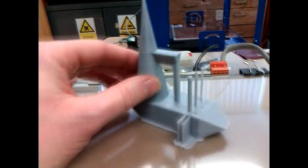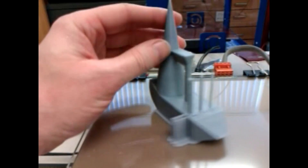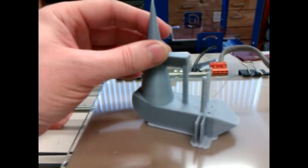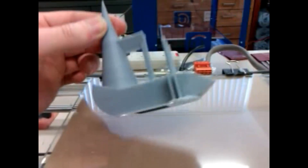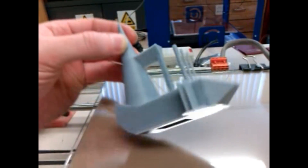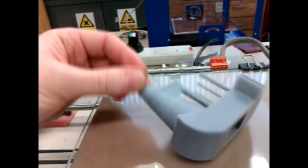I don't think I've got the extrusion multiplier dialed, and I've basically not touched that setting, so the small hole is not quite all the way through. The other two are fine. The 0.4 millimeter wall didn't print, although the extrusion width defaults to 0.4, so I haven't played around trying to solve that. But on that front overhang, no support material — that's as crisp as anything. And likewise, this rear curve looks pretty good.